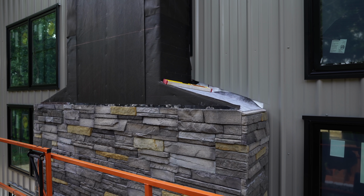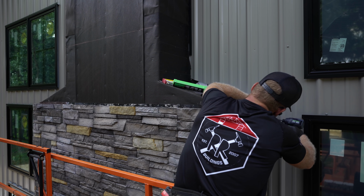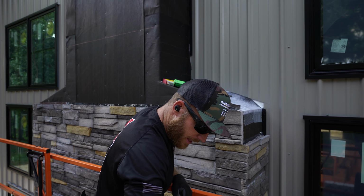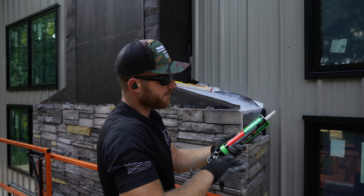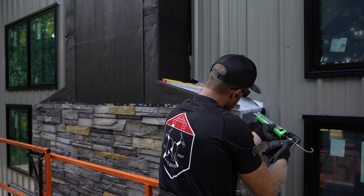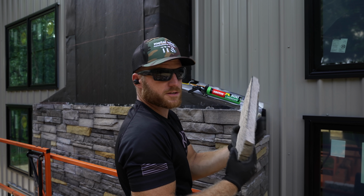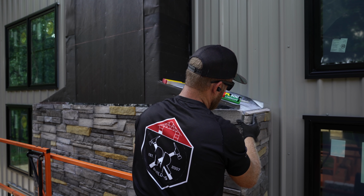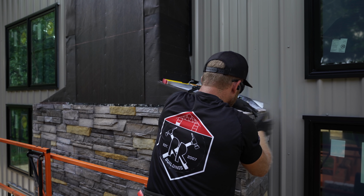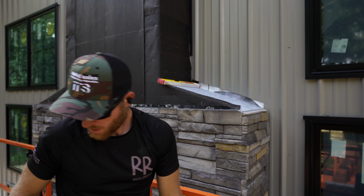So, how do we fasten this? I'm going to take some stainless steel mesh. We're going to screw that on, and then we're going to take some landscape construction block adhesive. And that's what we're gonna set this guy into. It's super coarse. It's gonna really lock on really well. Now we can go ahead and get this guy here, which I'm definitely gonna wanna use a full piece.